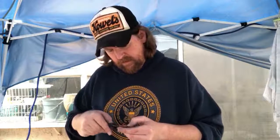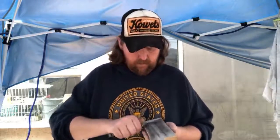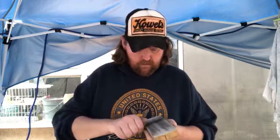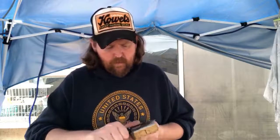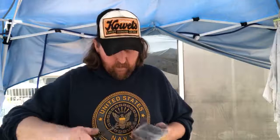Yeah, guys, I got a little bit more refining to do on the strops, and then this is done. This is super clean, super nice. Go back down through the strops a couple more times just to see if any of those little imperfections come out. There's always little imperfections and marks when you refinish, and so all I'm doing is knocking shoulders off that I missed throughout the sharpening process, so that it looks like a full convex and does not have that weird facet where you can see where I changed angles. I'm not actually at the apex.